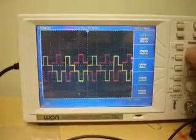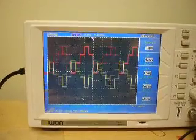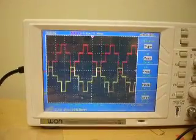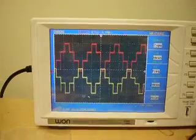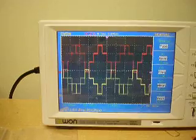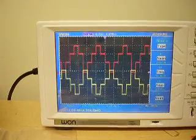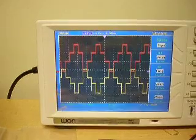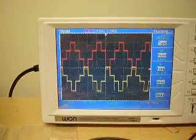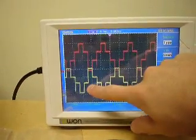As you can see the waves overlap each other. When the red one is at 100% duty cycle, the yellow one should be at 0% duty cycle, and vice versa. There are three stages in the middle where they meet. I'm not sure exactly what's going on — I think my timer is cutting off early, which is why this portion of the wave keeps popping in.